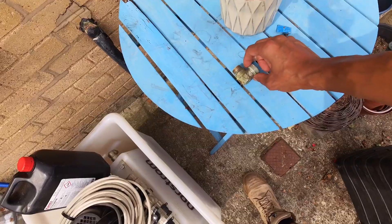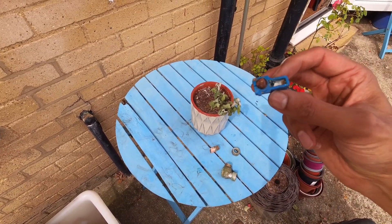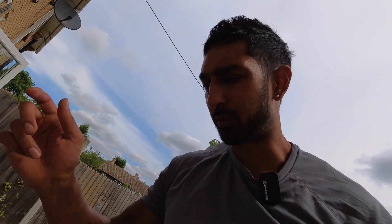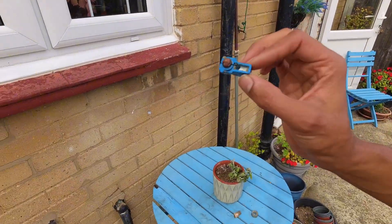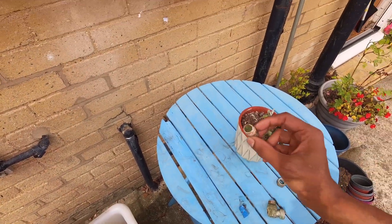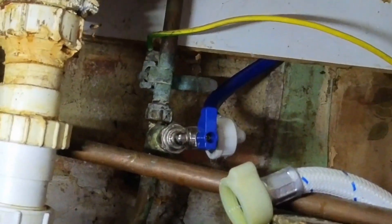The first hurdle was sorting out the cold feed - the old washing machine valve I was trying to take the cold feed from. Luckily I had turned the water off because when I tried turning it, the handle was just rounding off. I tried cracking the washing machine hose off and it was still spraying out. So I turned the main stopcock off, which luckily does turn off. Then I tried turning it with a set of grips and it completely broke off inside. Imagine if I'd done that while it was live - that would have been a problem. So I had to cut the pipe back and put a new washing machine valve on. A new washing machine valve's on there, so that's now feeding the machine.